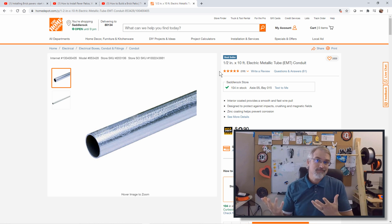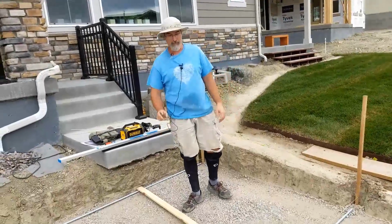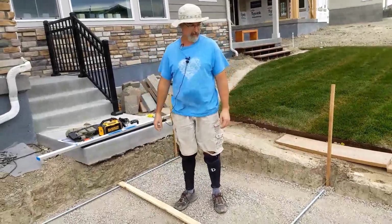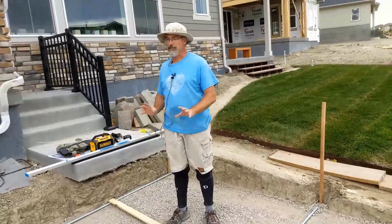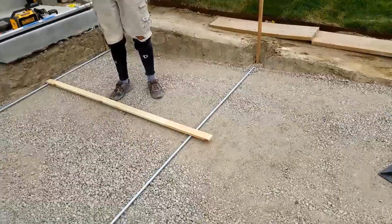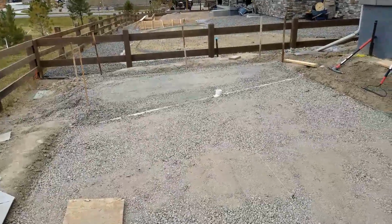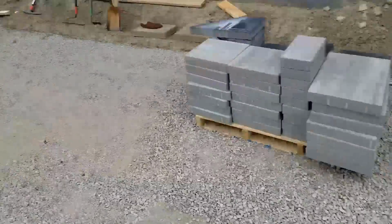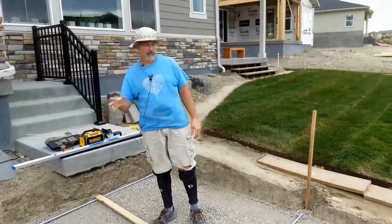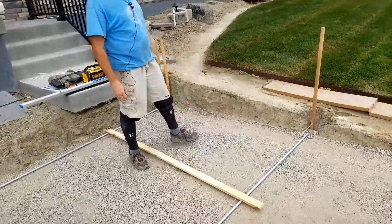And so with that, let me start into all these videos I made. Okay, here's where we're at right now. So we have built up 5 inches of base, 1 inch at a time, carefully building up, making sure it's measuring correctly and compacting it, and making sure we have a slope. At least an 1/8 inch slope, in some places a 1/4 inch slope. And we've also got our pipe in there, which we're going to use to feed in our gas line. For now, propane, in the future, natural gas. So now we got to get the sand in, and we've got this all measured precisely.